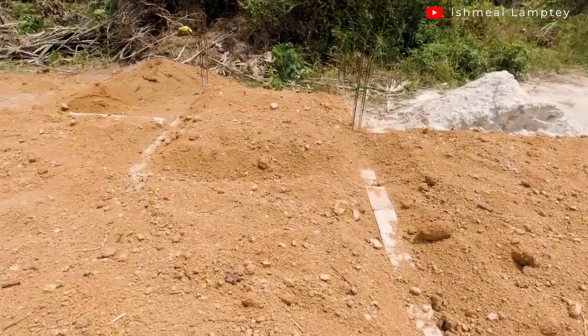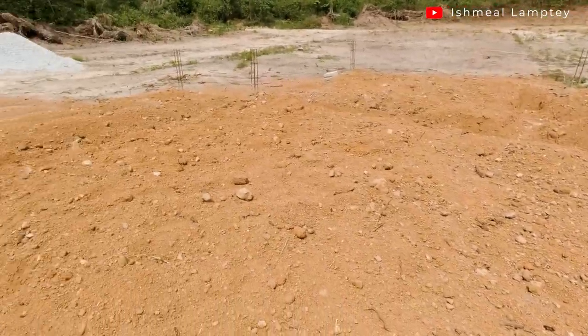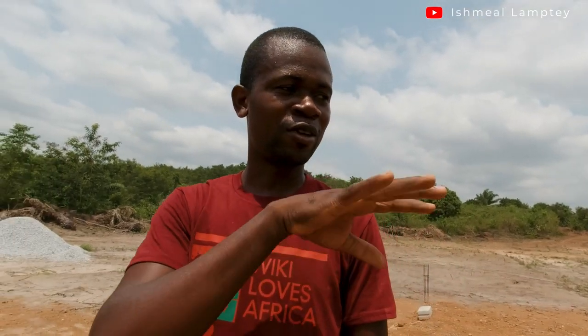At this point it is very important not to rush the process. You have to allow it to settle a little bit, else you might finish your concrete works, wait some time, and then notice that part of your concrete is beginning to sink in — because it is then that it begins to settle properly. We've left this for over a week now to allow the rain to do its part, and we've been blessed with some rain, so once the ramping is done I'll share that with you as well.